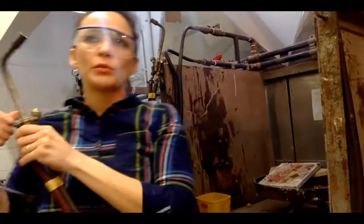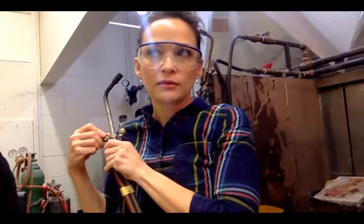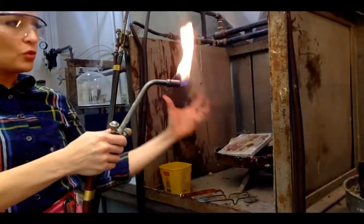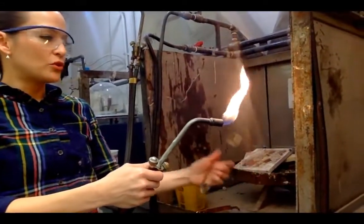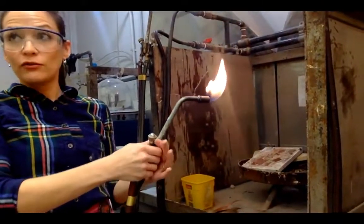What I'm going to do is turn on the gas first — not full blast, but you can hear it coming out. You don't want to let that run forever because then you're just filling the air with natural gas. So as soon as you turn it on, you want to put that striker to it. Sometimes it's hard to hold the torch and strike it, so if you need two people — one person to strike it — because sometimes it takes a couple tries. Now I officially have fire.